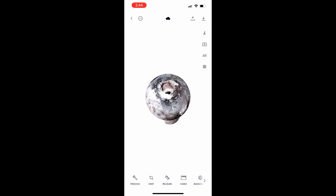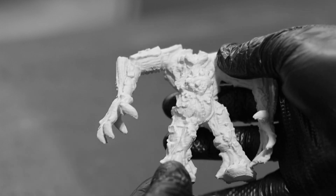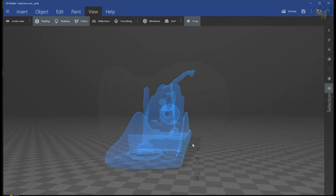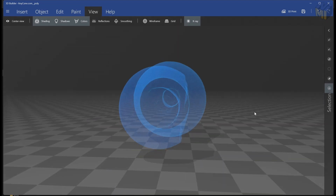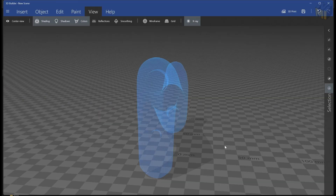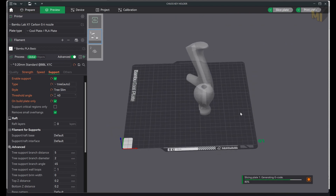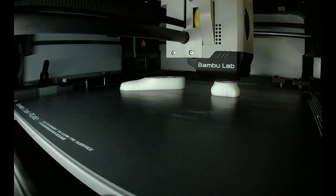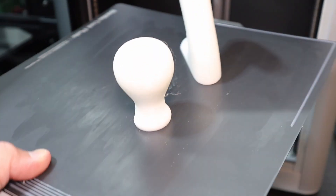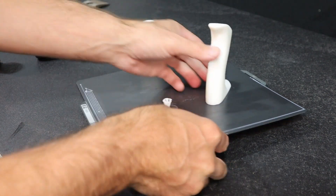I've already covered the process of capturing extremely detailed scans in several previous videos — link above. In this case I've used some hairspray to adhere baking soda to the surface, which lightens everything up and reduces the sheen, giving much better quality scans. I've taken scans of the frame, the tote, and the knob, and in Fusion 360 I've scaled those 3D models to make sure they're accurate. Then I re-printed a full-scale sample of the tote and knob to verify the model. This Creality filament is one of my favorites for accuracy, but it turns out it's not great for showing detail.